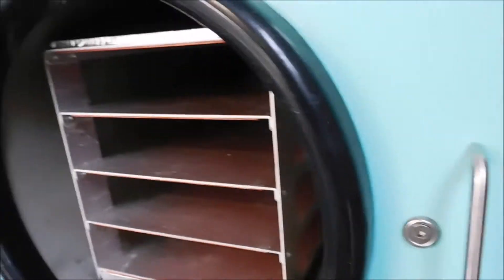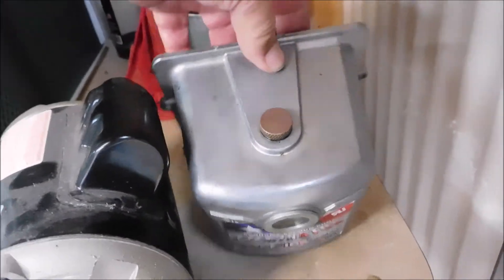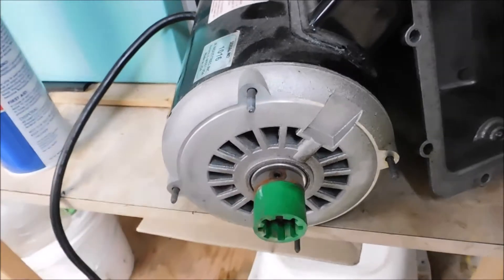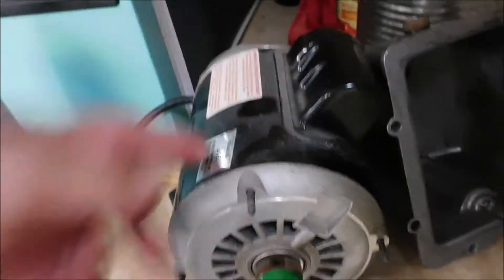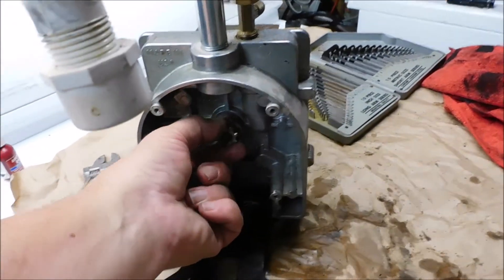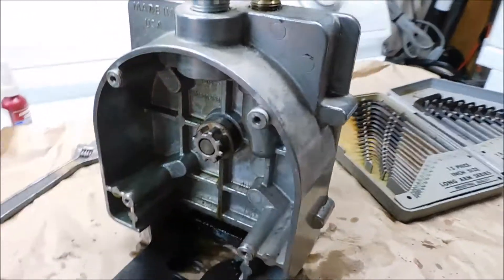I have to work on the vacuum pump for the freeze dryer. I got the front cover off. The motor has a little star coupling that goes from the motor. There's four long screws holding the pump in. There's a seal back in behind here — it's leaking.